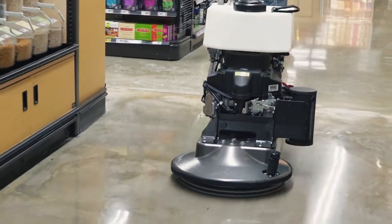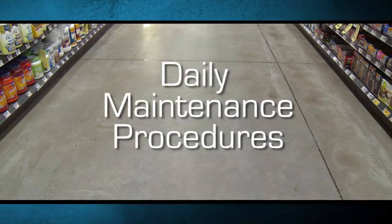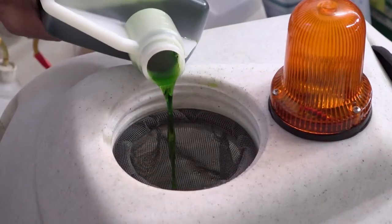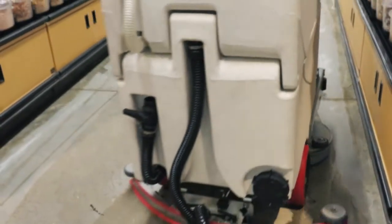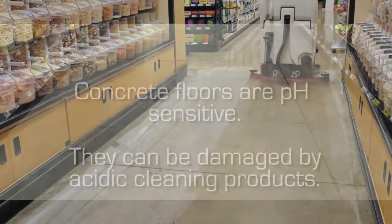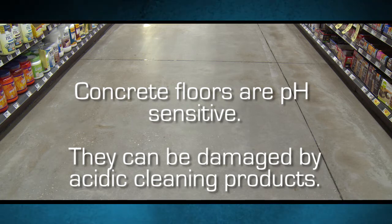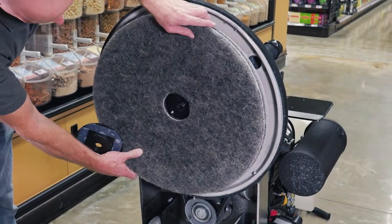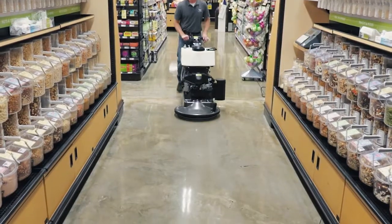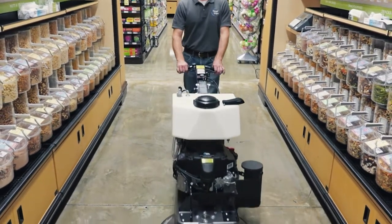Burnish with a Power Polish HT Pad or a 3,000 grit diamond impregnated pad. Daily Maintenance Procedures: Clean the floor with Reclaim Hard Floor Cleaner and Maintainer at the recommended dilution ratio. If using an automatic scrubber, use a soft red or white cleaning pad. Concrete floors are pH sensitive and can be damaged by acidic cleaning products. Burnish the floor using a Power Polish HT or 3,000 grit diamond floor pad. Daily burnishing will significantly prolong gloss levels and aid in the removal of minor surface scratches.